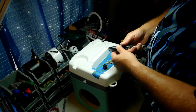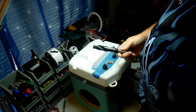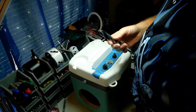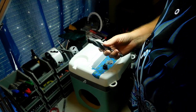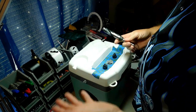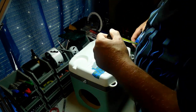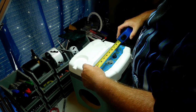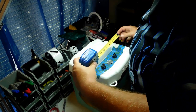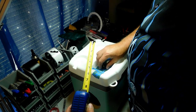Since I do a lot of metal boxes, I went ahead and invested in a 13/16th drill bit — it's a monster but it does really well. I'm going to drill a pilot hole first to get it started. This bit will go through plastic like a hot knife through butter, so put your drill on the slower setting or you'll get a lot of tear-out. It was about 25 dollars but worth it since I drill so many holes. Find the halfway point across the lid — about 4 and a quarter inches — and mark your center points on both sides.